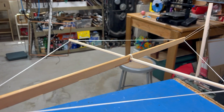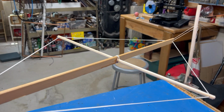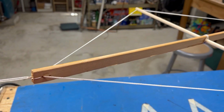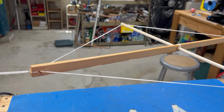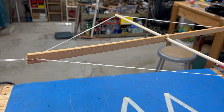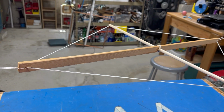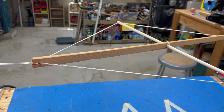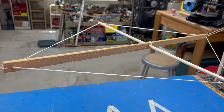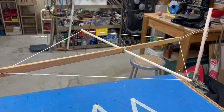Now, the characteristic impedance of this is somewhere around 450 to 600 ohms. So I fed mine with twin lead, and I brought that into the house, and that worked fantastic for the FM broadcast band. And then I built a link couple tuner to work on 2 meters. And I worked down into Delaware on 2 meters with this particular antenna. And I'll show you pictures.